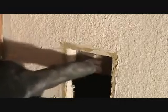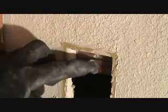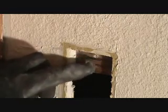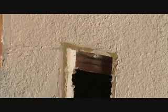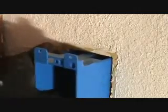Okay, here's my plan. There's a little lip on the back side, and that's enough for me to get a screw in. So I don't want to drill out all of this all the way up to my cut. I measured this notch here, and it's 3/8 of an inch. So from the top of the sheetrock on down to the wood, I made a mark at 3/8. I first measured from the bottom of the wood, and then I started thinking later, hey, wait a minute, it's got to go from the top down, not from the bottom up. Okay, that'll give me this little ledge, and then I can put the screws in there and properly mount this.